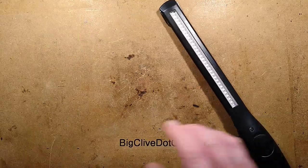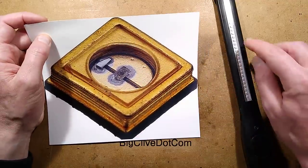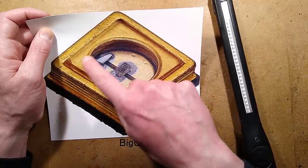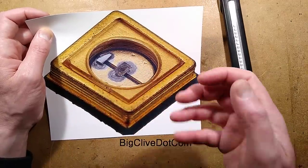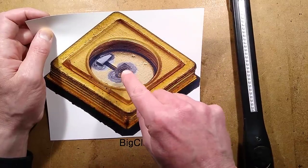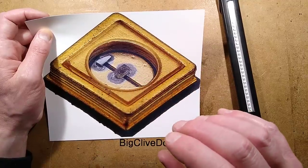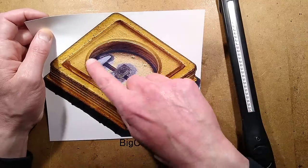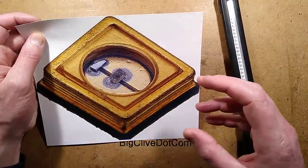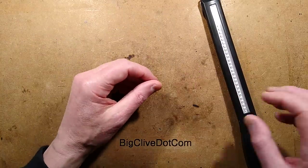Partly because real UVC LEDs have to have a special construction, because otherwise little resin ones like this would be damaged by the UV. So they have a metal body and a sort of quartz window, and they emit virtually no light. You might see a very, very faint glow, but because LEDs are single wavelength devices, they do not effectively emit light. Quite often they're used with either another LED in the package or one in the circuit board, so you can tell it's actually lit, because otherwise you'd be staring directly at something dangerous without knowing it.